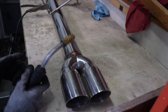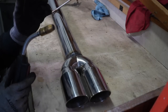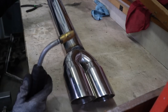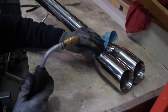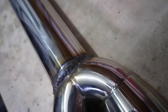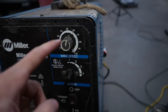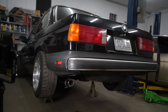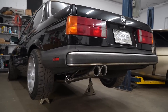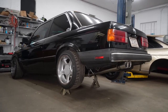Oh my god, changing the settings on the welder made such a difference. I was always so used to flux core blowing a hole every single time, but I have gas on this welder - this is solid wire, not flux core. This is a hundred times easier now. On this side is when I fixed the welder and turned the heat down. On the other side it kept blowing holes through because the machine was too hot - I turned the wire speed up to four trying to feed more material and then put it at two and it was way better. Damn, it actually looks really good. I like it a lot. I can't wait to hear it.